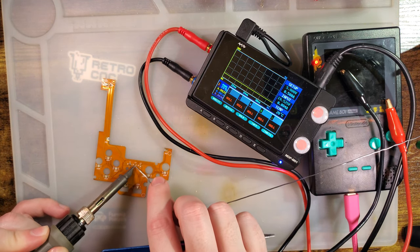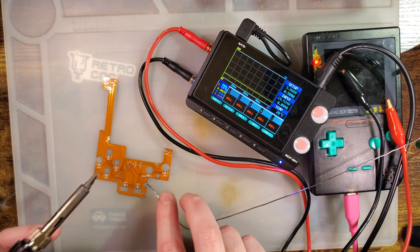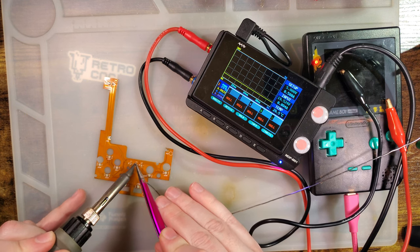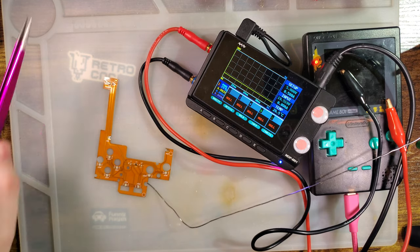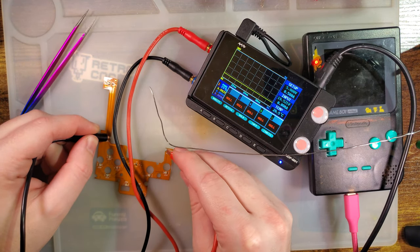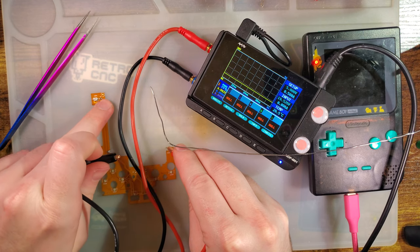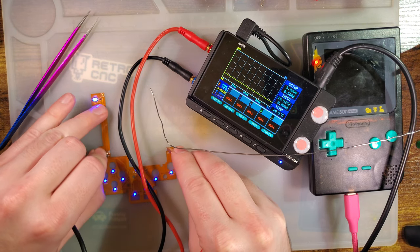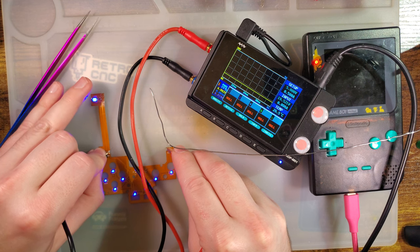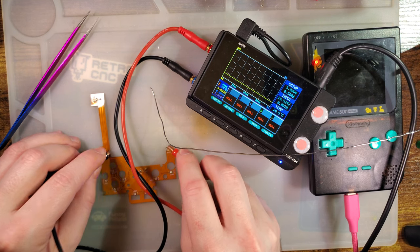Let's try out the other resistor positions and see what it looks like. I'm going to tin these pads — that's just a matter of lifting that resistor and putting it right there. Blue. It might be kind of hard to see the power LED up here, but this one is always blue regardless of what you set the buttons to. That is not an RGB LED, so it is what it is. I think it's fine. The blue LEDs also pull a whopping 4 milliamps.